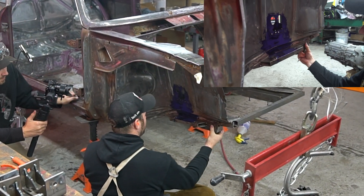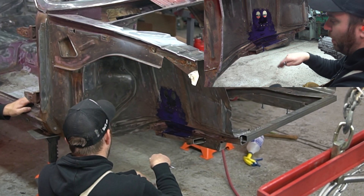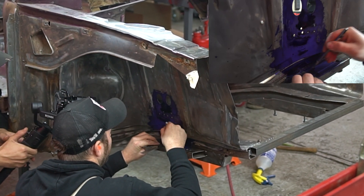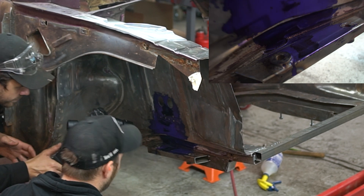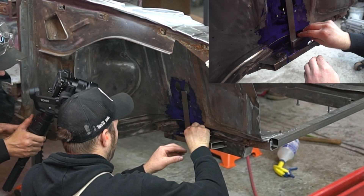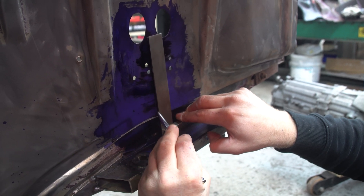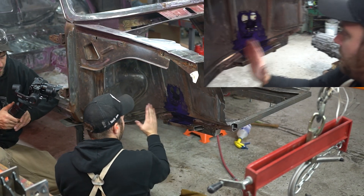The whole goal of what we're doing right now is we've got to move this up two inches, so we can cut this bar out so that our subframe will move up two inches and we'll have the proper angle for our lower control arm. I did it all in Dykem blue. I'm just going to make a line here that's square to this piece, and then do another line going up the side of this body, square to that. So now we've got a line on here and a line up here, so when we move it up we can line them up and get the right position.